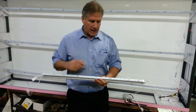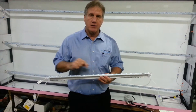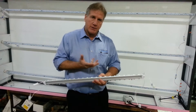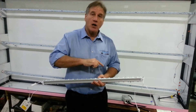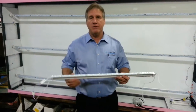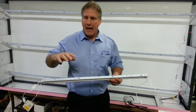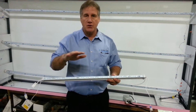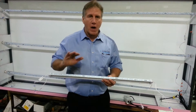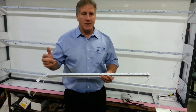Now this product has a 170-degree beam angle and it also has a 360-degree bat wing, meaning that it's diffusing the light 170 degrees in a 360-degree pattern. This gives you very ample light and also diffuses it beautifully, so that you can place them on much wider centers than you normally would with other LEDs and even lamps.